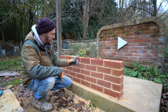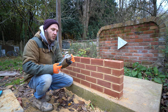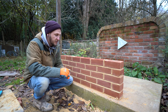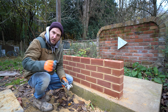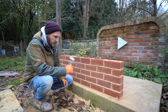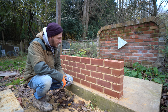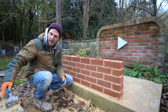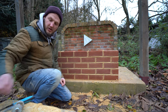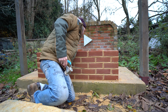So, first side: from these two perps - it's one, two, three, four, six bricks wide - these perps will designate the middle of the wall. This side I'm not going to worry too much about depth, I'll just keep it as it is - about five to six mil. I'll iron it over and then turn it around. I'm not going to be too fussed if it's not exactly six mil because I haven't got a tape here. Let's move the camera to get a nice view of it. Right, we're all ready to go - this line, these three perps this side, raked out. Let's start the timer.